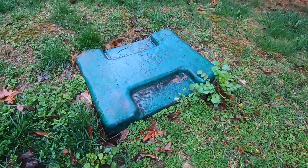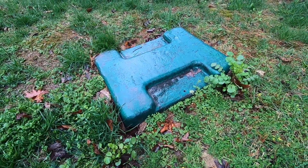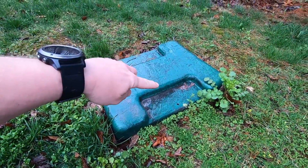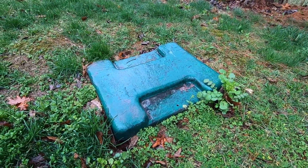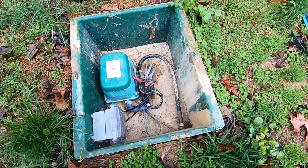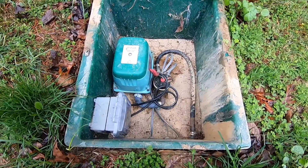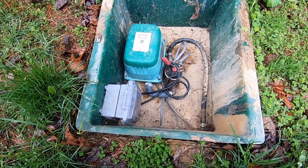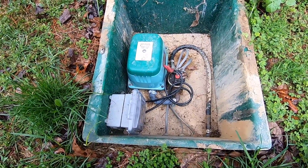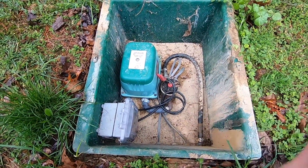Sounds like the pump is not working. Depending on what type of pump you have, either the blades or the diaphragm will go out - it's just a couple of bolts on both sides that secure the lid on top. The first step is to turn off the power at the breaker box. Locate the correct breaker and make sure the power is off - you'll usually know you have the correct breaker because your alarm will stop sounding in the basement.